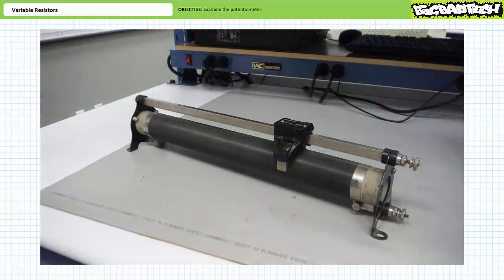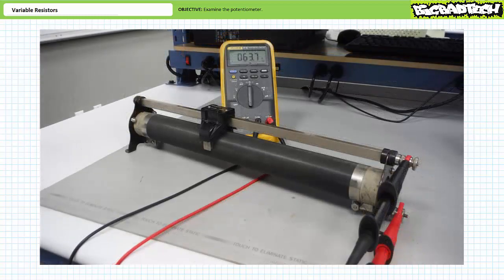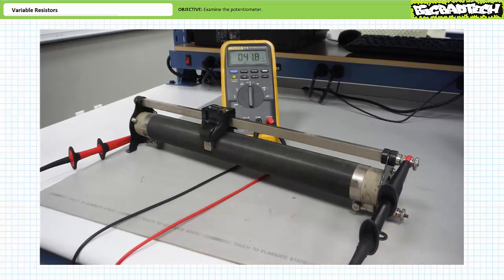Here's another potentiometer intended for high-power applications. Rather than an adjustment screw, this device uses a sliding wiper on a track that clearly illustrates the internal functionality of a potentiometer. When I check resistance between the two outside screw terminals, the ohmmeter registers a constant 106.2 ohms regardless of how far or fast I drag the wiper — these are obviously the fixed terminals A and C. Transferring one lead to the upper B terminal, the ohmmeter shows roughly 63.7 ohms between B and C, and the remaining 41.8 ohms between A and B.